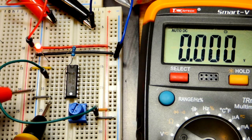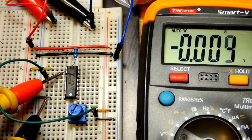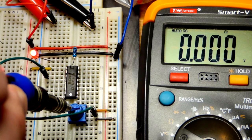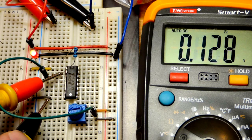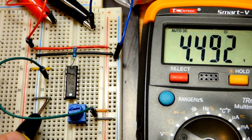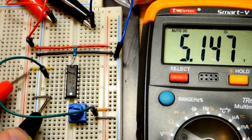Even though the LED is on in sinking mode, the output voltage is low. The LED prevents it from going all the way to the rail. Going back to the normal setup where the LED is on when the output is high - right at the switching point with the LED connected we saw about 2 volts out. Without a load, going a little above halfway, we can see the full rail voltage right there.